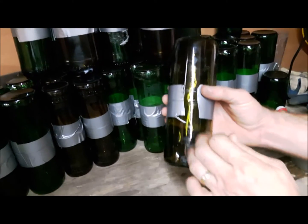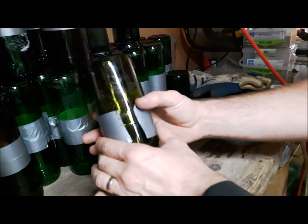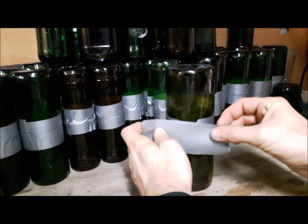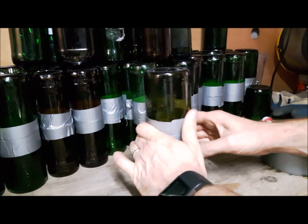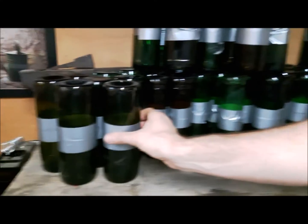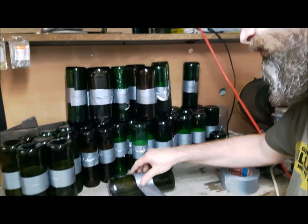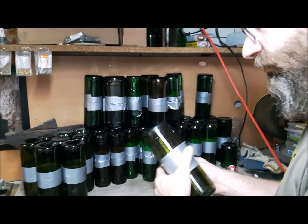If the tape doesn't quite make it all the way around, I do need to seal it because I don't want any concrete seeping into the glass brick — if any concrete goes in it will destroy the light effect by creating shadow inside. It doesn't matter if the glass bricks aren't exactly the same size, as long as they're basically the same size it'll work.